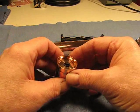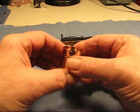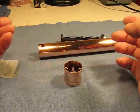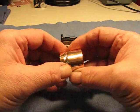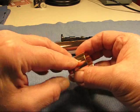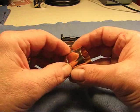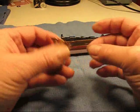I wanted to still be able to tail-stand this, and with just a one-inch copper coupling that would be hard, so I took a one-inch copper coupling and soldered it right to a one-inch copper end cap so I can still tail-stand it. The pins that lock into the J-channels are brass — one-eighth inch brass rod — cut down, holes drilled through the copper end cap, and soldered from the inside so the solder would wick right up through the hole and snug them in place.